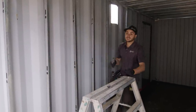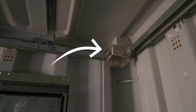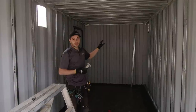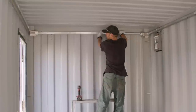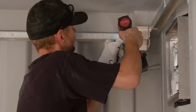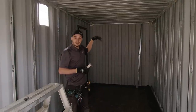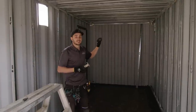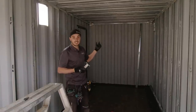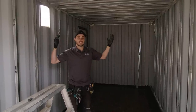With this system, if you were to purchase it, it would also come with the corner casting covers. A lot of containers have an angle iron back there rather than a rack tube, so the end wall corner casting covers connect to the top tracks of both side walls, and then connect the top track that runs across the end wall. That now defines everything on the same plane, the same distance away from the end wall, done prior to spray foam. This allows a nice even two inches of spray foam all around that corner casting — otherwise that corner casting could potentially be exposed inside your interior envelope, and it's going to frost, condensate, and drip all winter long. That solves that problem and allows us to get the maximum ceiling height.